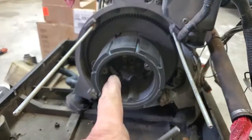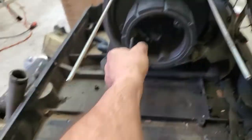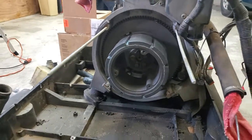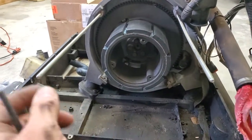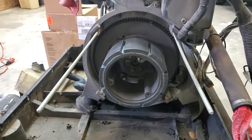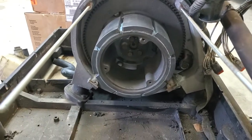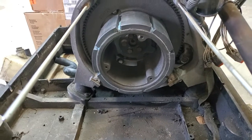This is a PMA — permanent magnet armature. The armature spins; that's the engine right there. These rods help me line up the holes and slide the stator on, stopping it from hitting, chipping, or cracking the magnets. If you get a fine hair crack in them — they're only epoxy — heat and age will eventually weaken the epoxy and the magnets will spin off.